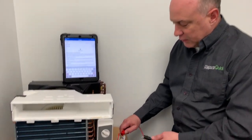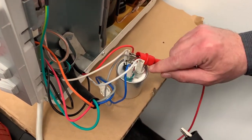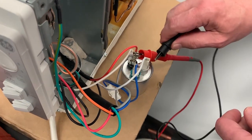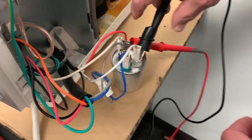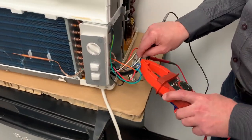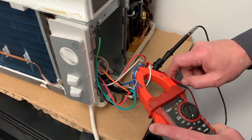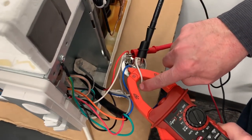What I'm going to do is connect one of my meter leads up to the common of the capacitor. You can see here — this is hermetic, and this one says fan. All I'm going to do is measure the voltage by whatever leg I'm going to test. So I'm going to clip the other one on hermetic for now, and then clamp the clamp meter around the hermetic leg, just all by itself on the hermetic leg. You want to have the clamp meter connected with the lead going right about where I have it here — that'll give you the most accurate reading.